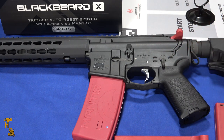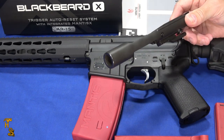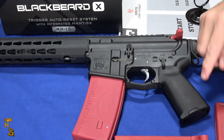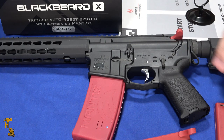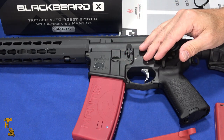All you really need to do is field strip it, remove the existing bolt leaving it intact. So you just pop the rear pin out, pull the bolt and the charging handle out, slide this bolt in, and close it back up. It's important to note there's no tools, there's no modifications. Everything on this rifle will be the exact same as it was when I put the original bolt back.